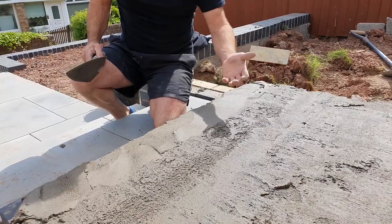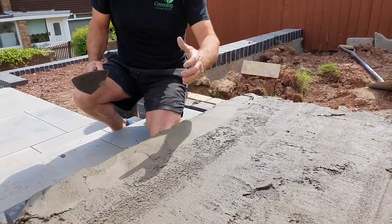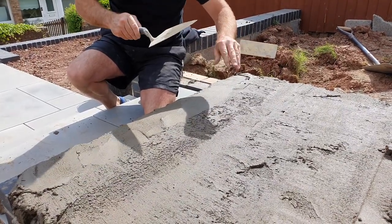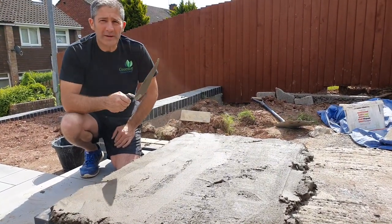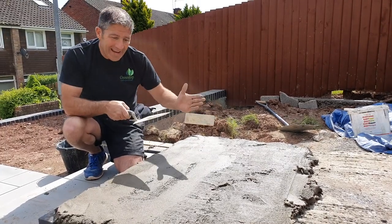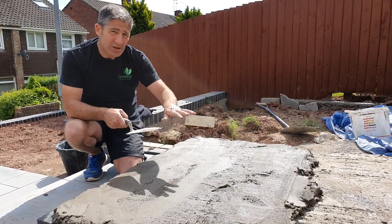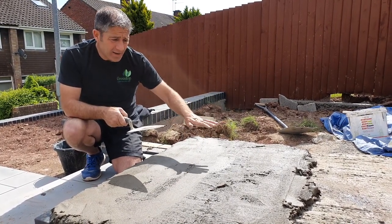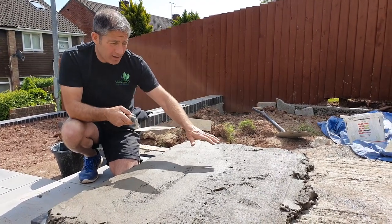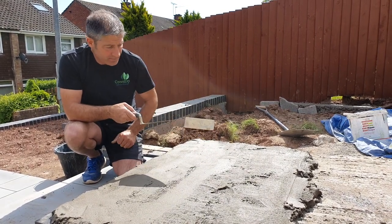Here we are - this is what we call a full bed, and as you can see it's totally flat all the way. That's going to ensure full contact between the slab and the bedding mortar, which is so important. The last thing you want is voids in your bedding mortar - that's where water can accumulate, you get the freeze-thaw effect, and your slab's going to come off. We've turned the mixer off so you can hear the full detail. You can see it's perfectly flat - no voids underneath the paving, because water can accumulate through condensation, drop into any divots, and eventually that slab will pop.